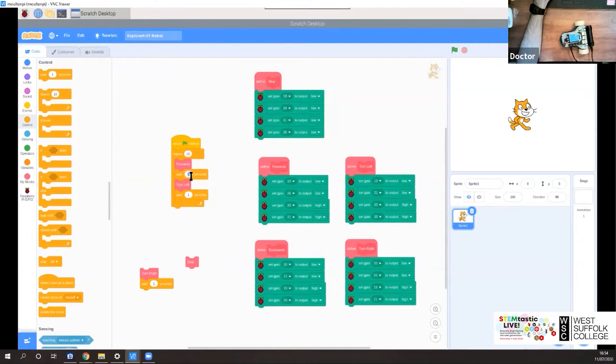And I'm going to actually just bring these down to 0.5 seconds so that I don't run off the table. And because I'm not sure quite how far the robot will turn in 1 second, I think 1 second took it slightly less than, let's go for 1.2 seconds. And I'm going to say do that 4 times. And then most important, don't forget to tell it to stop at the end. Otherwise your robot will just keep driving off into the sunset. So let's give that a go.